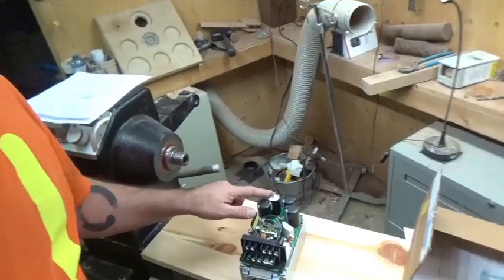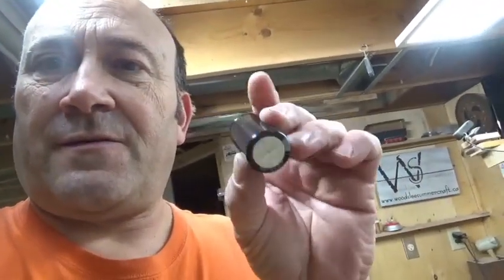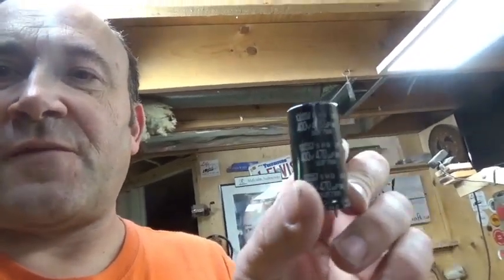I've been looking into it — I bought another one to try to make it work, and I have since discovered a capacitor that blew on the lathe's VFD. I contacted a company called Digikey and purchased four replacement capacitors. This is the replacement — it's exactly the same: 400 volts at 470 microfarads.